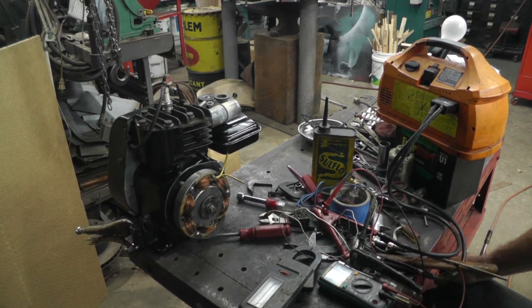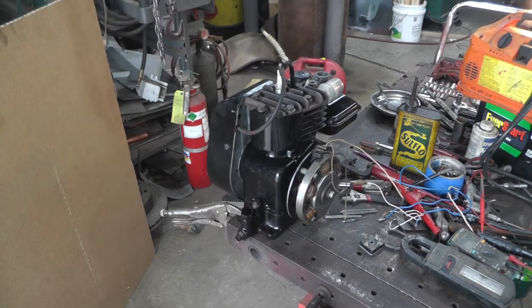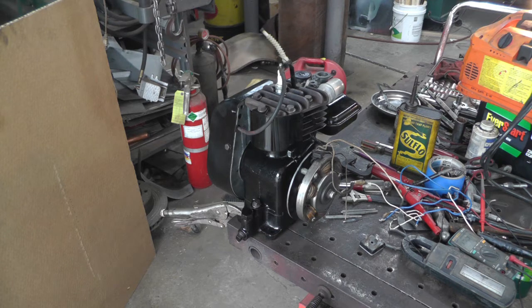Hope you're enjoying it. Okay, I hope you'll be able to hear me. I went up and found one of those other coils, put it on. It's doing about 3.5 amps, same speed. So it doesn't do as well as my rewound one. If I speed the engine up wide open, it will make about 5, but that's it. So my rewound one works better, I think, because I don't want the engine screaming. Around 1800 RPM seems nice.